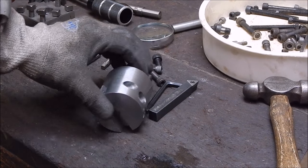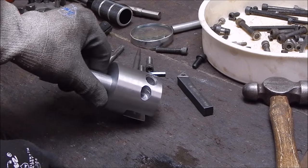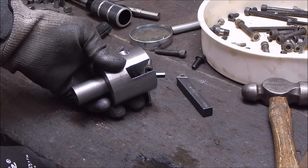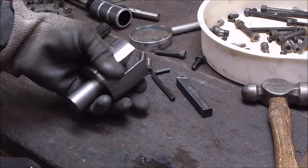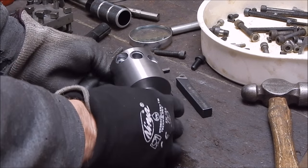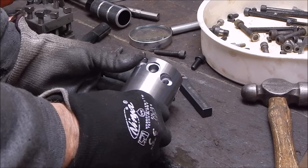Right, well, we're just about done with the milling and the tapping and all the rest of it. Now it's just a matter of just turn it to final size. That's why, you know, always start off, leave a bit more than you need, and then you clean it up in the final pass. So I'll just turn it down to 20 mil and just run the finishing cutter over this and cut some bolts to length.